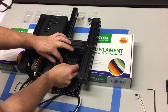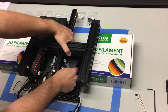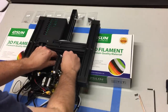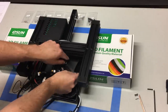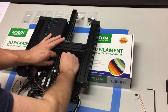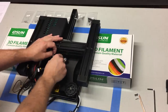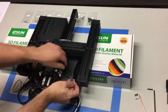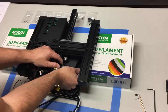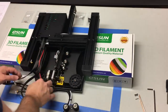You're going to rotate it, and depending on how it was assembled, it will rotate either clockwise or counterclockwise. What you want is to have these tight enough that there's no wobble on the plate, but still loose enough that you can barely twist the wheel with your fingers — not free spin, but able to grasp it with two or three fingers and turn with force. If you get it too tight you cannot turn it at all, you're going to get excessive wear and flat spots on the wheel. So just toy with it until you get it to that point.